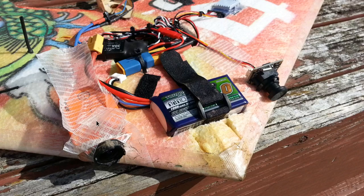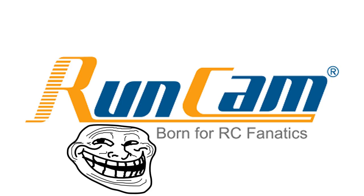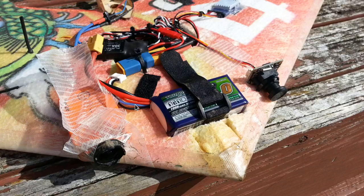And you'll also notice, I don't know if anybody watching this saw my other video where I was flying this FPV, that I used to use this Runcam 2 as my FPV camera by using the AV out to plug into the video transmitter, but you'll see here that I'm not doing that anymore. I'm using a dedicated board cam, and the reason was that on one of my earlier trips when I was going out to test the range, I got about a kilometer away, everything was going very, very well, and then all of a sudden I was looking at the Runcam splash screen that the camera shows when it starts up. I wasn't very impressed with that because the video didn't come back. All I could see after the splash screen went away was static, and so I had to go out there and try and find it, which I fortunately did.